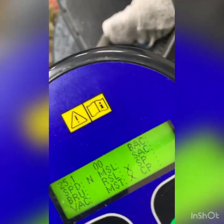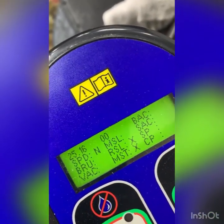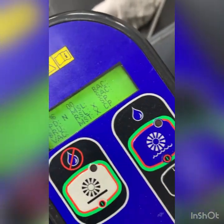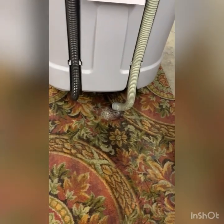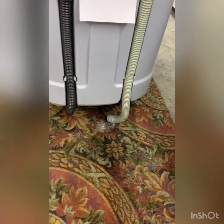So I'm just lifting the deck back up. So I turned off the brush motors as well. So notice how it climbs back up, but it's not going to do us any good when we're down below 24 volts. So we got a battery issue for starters. The vac motors, they're questionable. So right now it's kind of looking towards the amount of voltage that we're generating from these batteries is making the vacuum motors suffer.